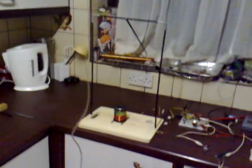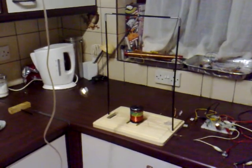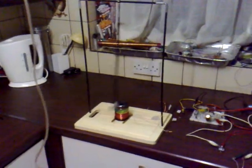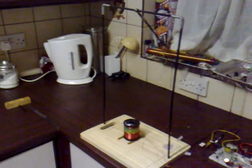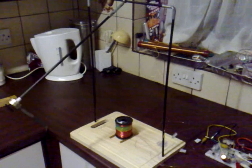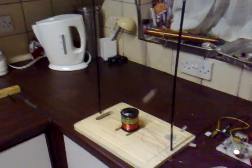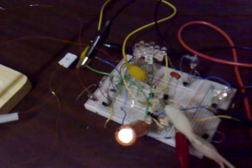I've got the array attached to the metal housing now and it's very unobtrusive — you wouldn't even know it was there. I've got some wires attached leading down and the pendulum is swinging again, swinging really well. The voltage on the cap is just over four volts and climbing. This is the first pendulum I've ever built and I think they're very economical — the duty cycle is quite amazing, really. This is on the minimum setting of this circuit and it's got a little LED which flashes away.